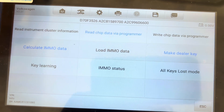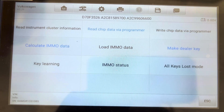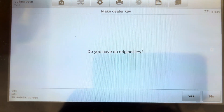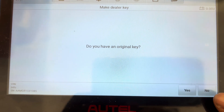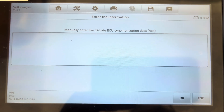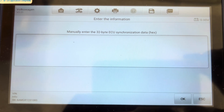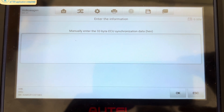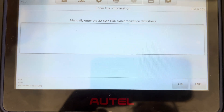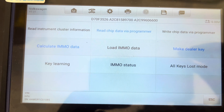So we can only go as far as just retrieving that data, calculating it and seeing our VIN number and the key data and everything else. Where we go to make the dealer key, it's going to ask: do you have an original key? In this case it's a no, we do not have. This is where the road ends because we need to have this number to generate the key. You would need either an MQB license, or if you just want to add a key you can proceed if you have an existing key. In our case we do not have an existing key, so this is where it ends. Thank you for watching.